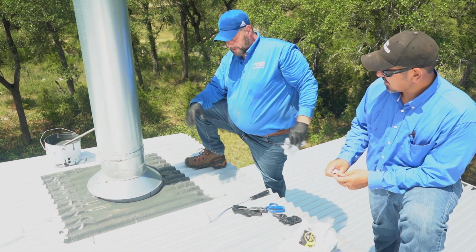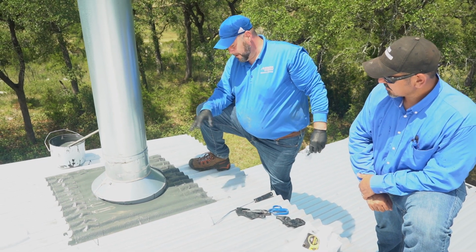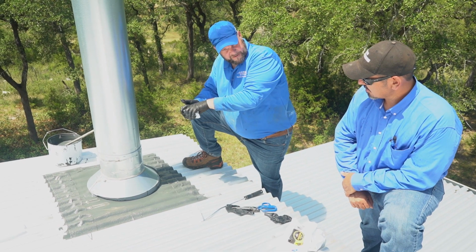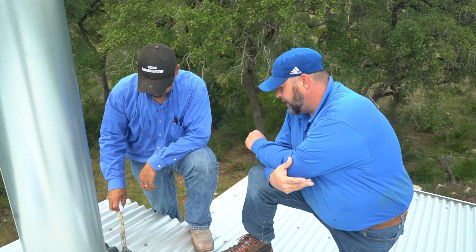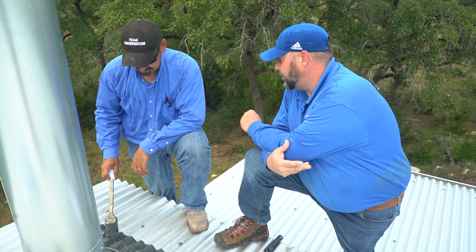48 hours, I'm gonna want you to scuff up the membrane, just because it'll lose its sheen. It'll lose your chemical bond. But within the first 48 hours, you can go right over it. We can come do another video once you get another run, and then once you guys get into doing it, we'll come out and certify you guys on how to do it.